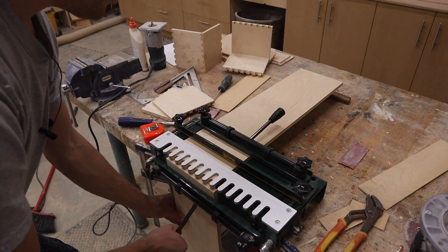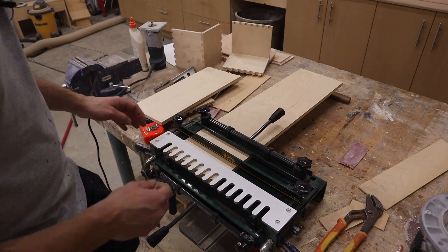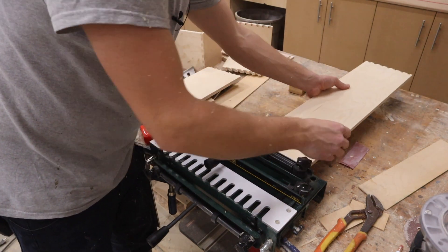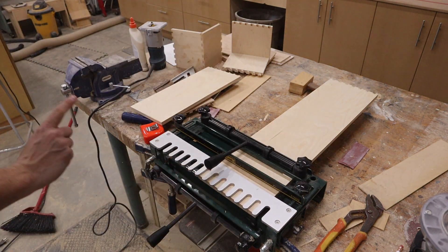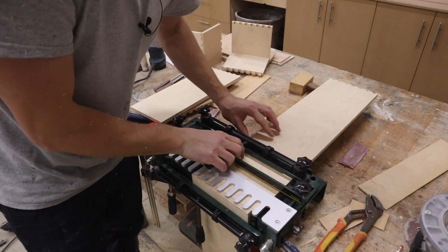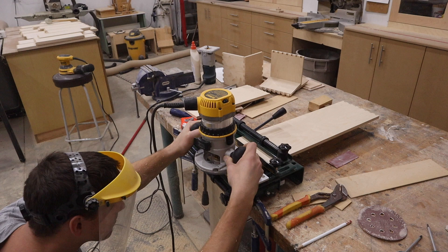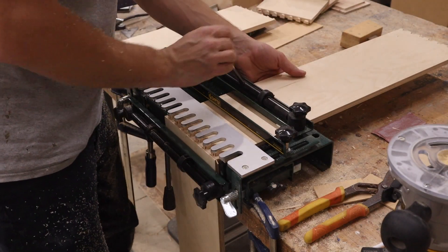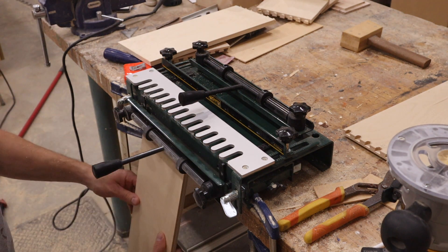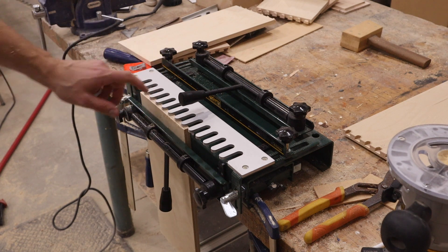Now you've got your first corner cut. Take that piece out and set it to the side — you can see that one has a one and a four, so the four we're going to cut last. Take your top drawer piece, spin it around and slide it in. That's number two, so we have to take number two and butt it up against the comb. Now the drawer front is done. Take this piece and spin it around and slide it up on the other side. That's number three, so now we have to get the back and get the three lined up for there.